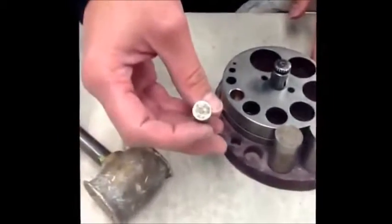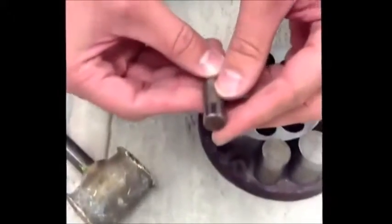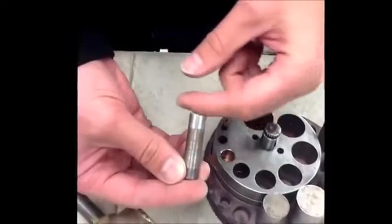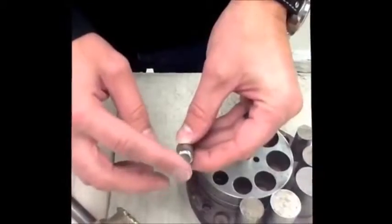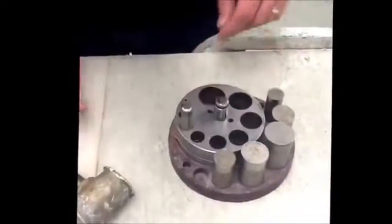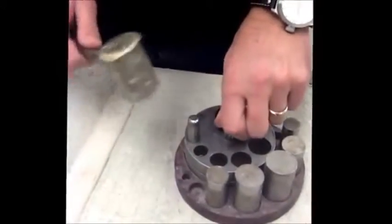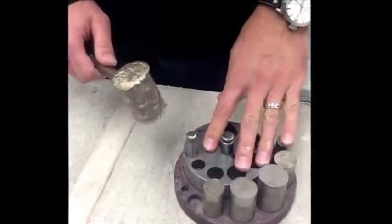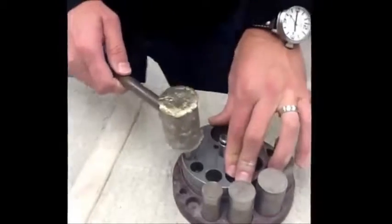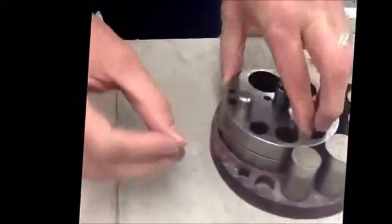Next we find the appropriate piece that fits inside the hole — the tip should be slightly sharpened and tilted to one side. This top part goes down head-first into the hole, and the back side is what we'll be pounding on. The hammer we use for this is the brass hammer — it's extremely heavy and gives enough force to drive this through the metal. Brace your hand on top of the tool and slowly pound on top. Once it drops through, lift it up and you'll have your circle punched out.